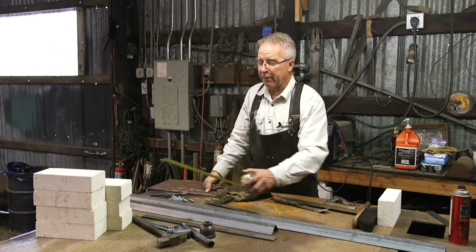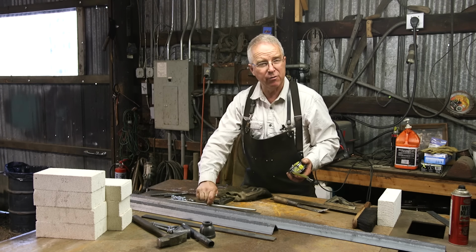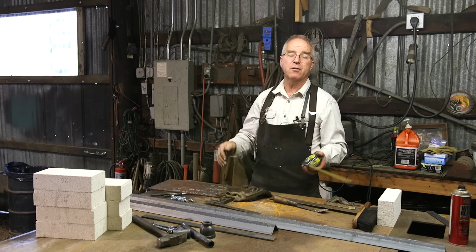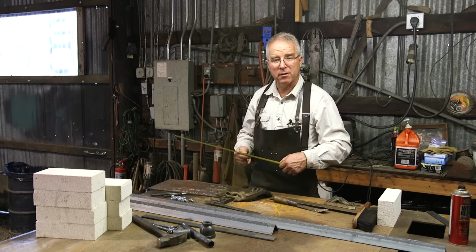It just uses lightweight fire brick, angle iron, little bar stock. You got to have some all thread. Did I mention that? 7/16 inch all thread. You got to have 4 12-inch pieces of that. So anyway, the cut list will be in the description. The sequence you can pick up by watching this thing go together. Let's lay out the steel, cut her to length.